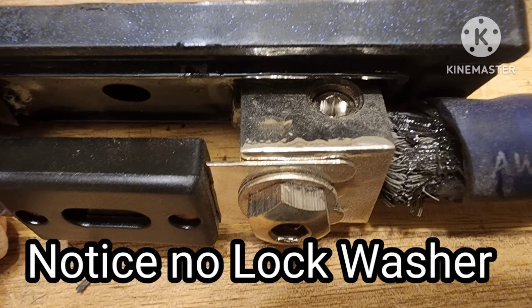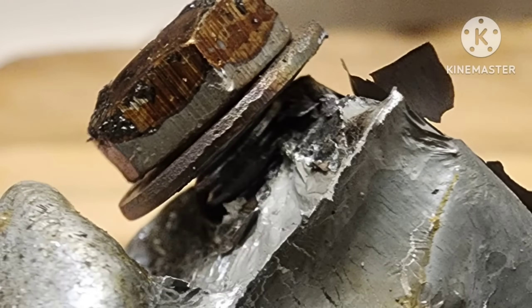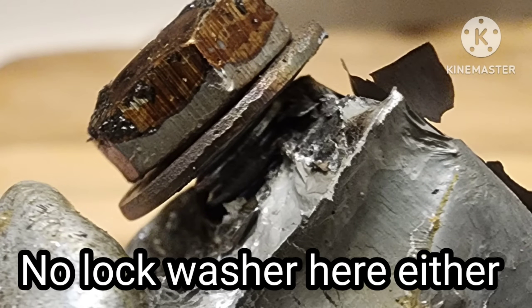This is something I didn't see coming until I started investigating the failure mode. The failure mode was the bolt backed out, and there are multiple ways to solve that problem. One of the ways you can solve it is with the application of a little blue Loctite on the thread — just put a little dab on there when you screw it in.